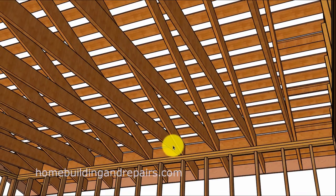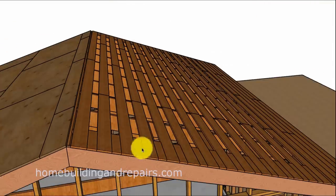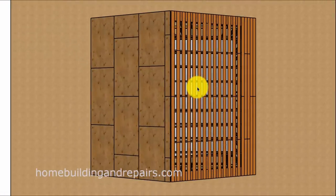This is probably what most of you have seen: a 1x6 roof in your garage or attic with plywood on top of it and composition shingles. If that's the case, you're not looking at spaced sheathing. Spaced sheathing is only for cedar shakes or shingles — though I've also seen it used for tile. You're going to need solid sheathing for a composition roof. This was one of those things when everybody was shingling their houses with shingles, at least in California.